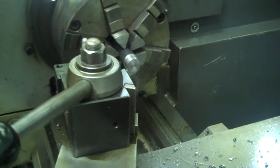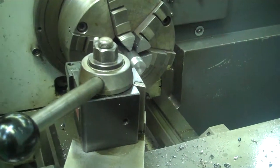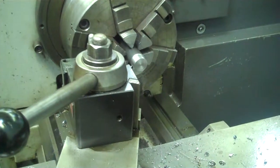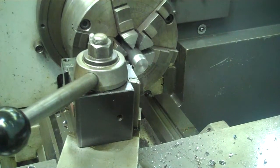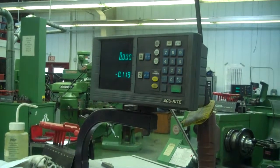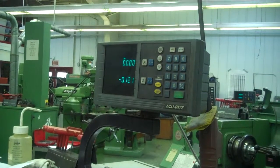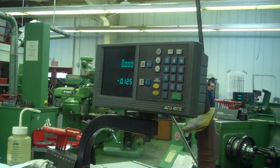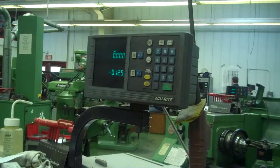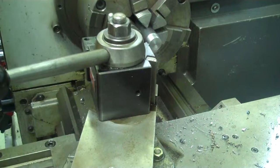Now I have to move over on my part. I have to move over 120 thousandths — I want a 120 thousandths step from the face. So I'll touch off here, set my zero, and move 120 thousandths. It's two-place decimals, so I've got 15 thousandths and I'm actually going to go about 5 thousandths more. Let me make sure my tool is locked down and I'll come up until I just touch on my part.